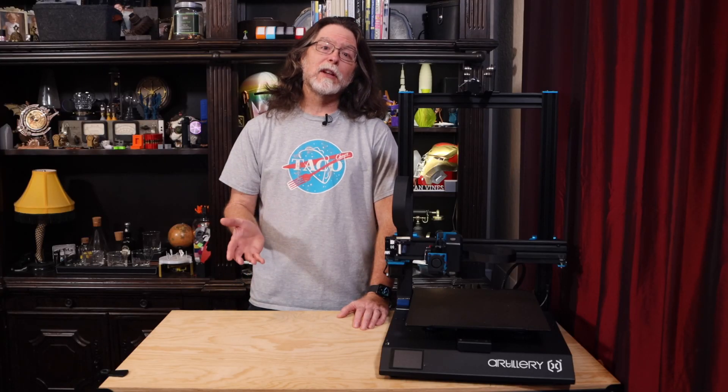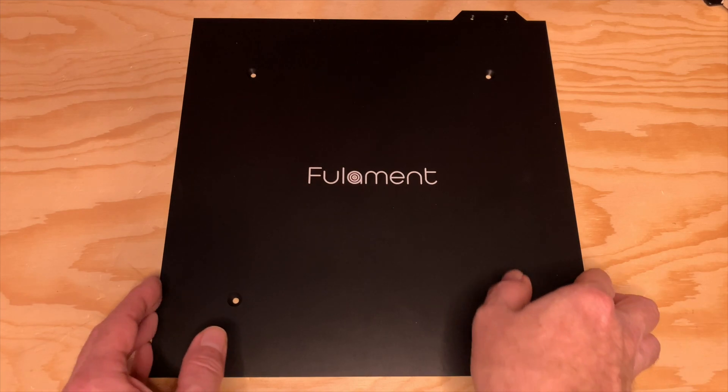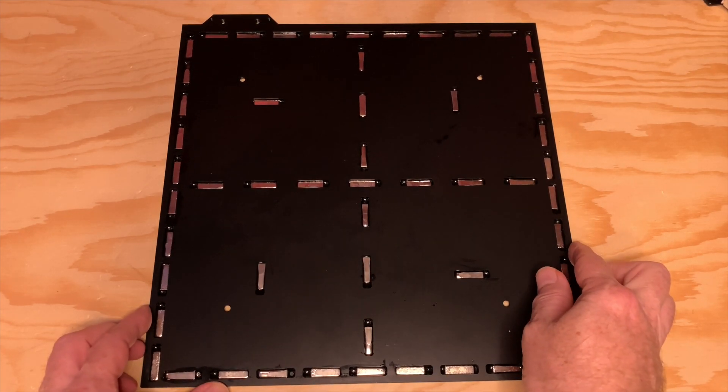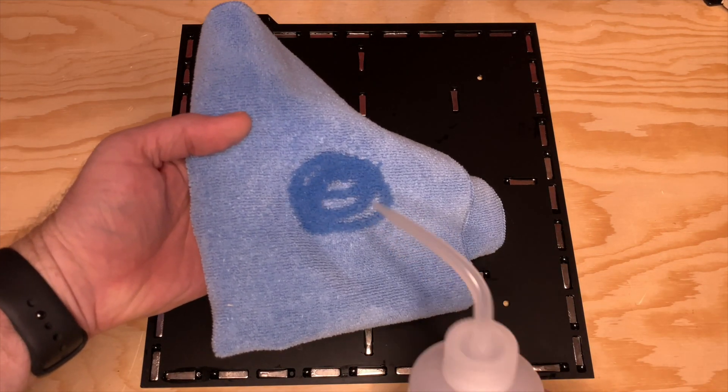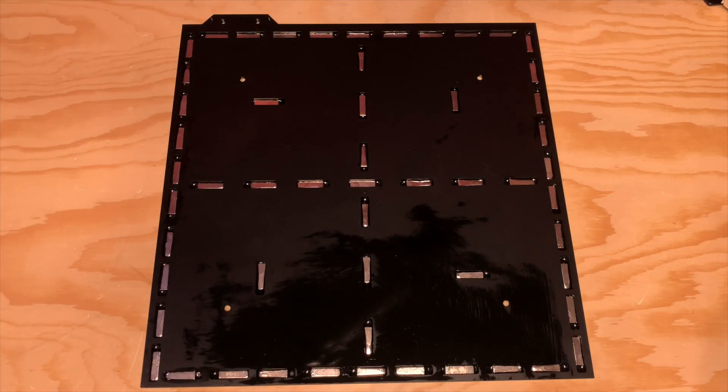Let's go through the installation in greater detail so you can see how to do it. I decided the best course of action would be to install the bed heater onto the Fullabed before doing anything else. It's a peel and stick thing, and once it's stuck, it's stuck, so you pretty much have to get it right the first time. The bed heater goes on the underside of the bed — that's the side where all the magnets live. I cleaned the underside with some isopropyl alcohol on a microfiber cloth and waited for it to dry.